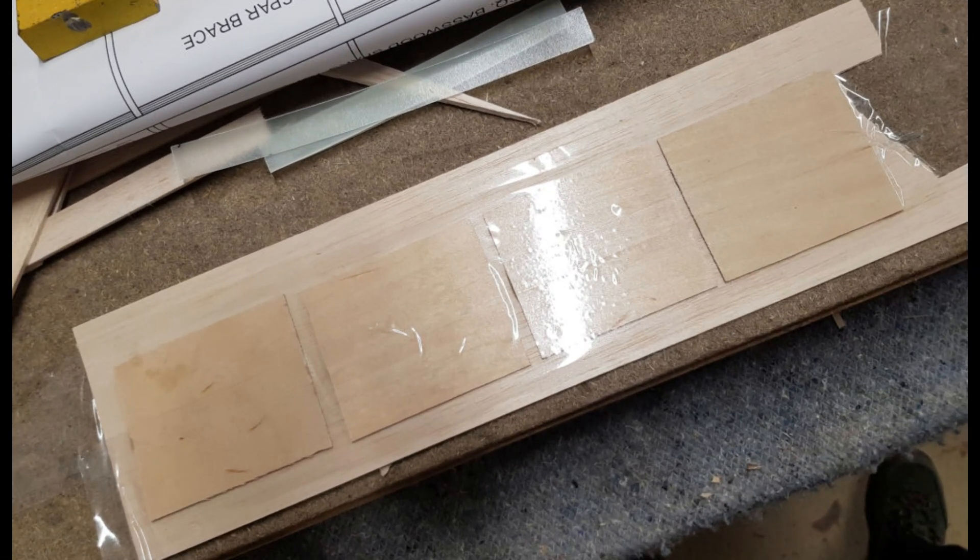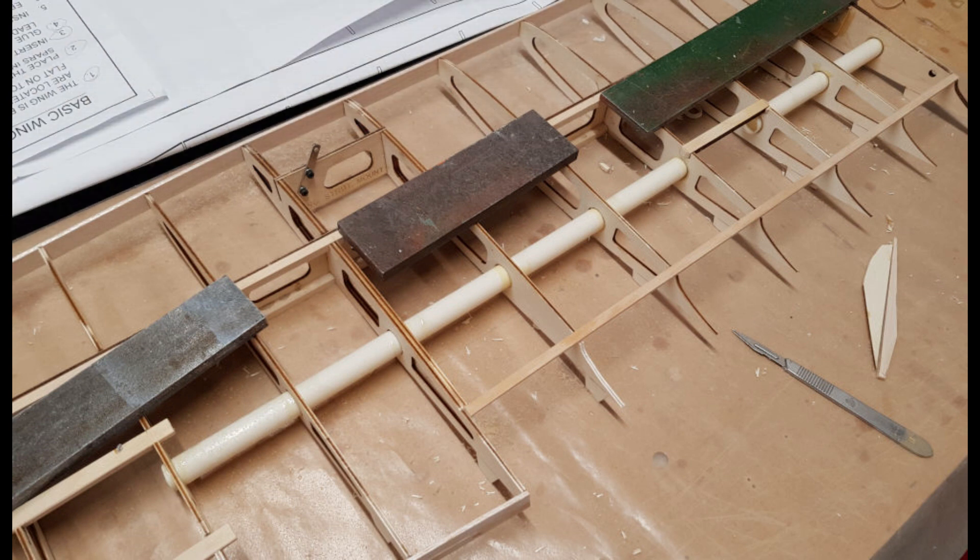Day 22. I made up the servo covers from 1.5mm plywood and 1mm balsa, making up the equivalent of the 2.5mm balsa skin. I used epoxy glue for this, as wood glue has water in it and warps glue-ups like these. I put plastic electrical conduits that I got for free in the wing for the servo wires. The instructions recommended rocket tubes, but these are not available where I live in Iceland. The holes in the ribs are 17.4mm and the tubes are 16mm, and they can be fastened quite rigidly with polyurethane glue.